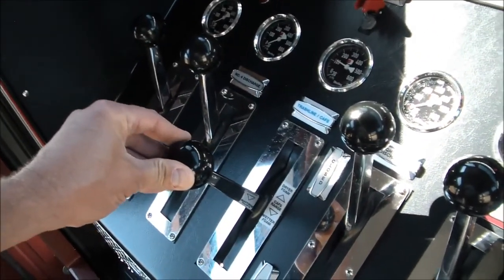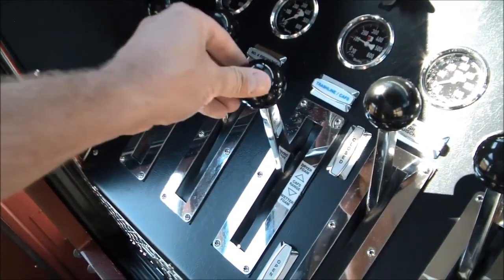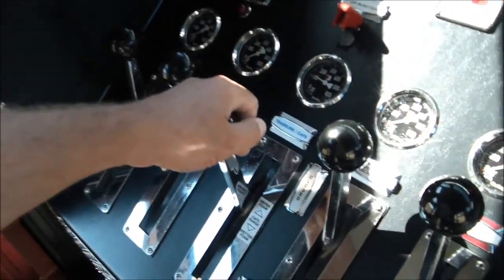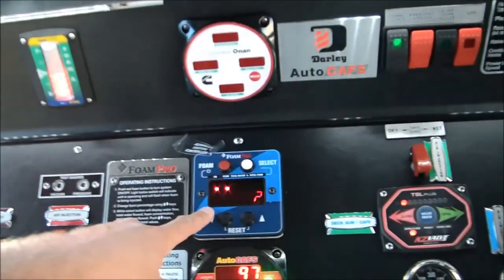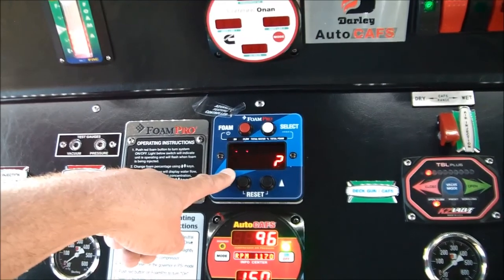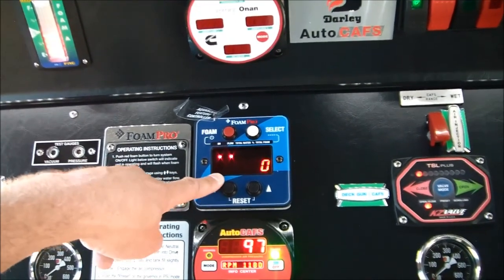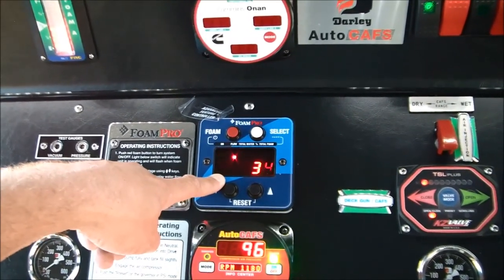If you just got a small room and contents fire, or if you want to make an exposure protection foam, you're just going to want to back it down towards drier. You don't want to close it off completely because then all you're spraying is plain air. So make sure you've got your valve open, somewhere between maybe 25 to 30, 35 gallons per minute to make the drier, fluffier foam. When you want to make a higher heat absorbing, fire knockdown foam, you want to be up over 50, 60 gallons per minute or more, so that you've got plenty of water to absorb the BTUs.